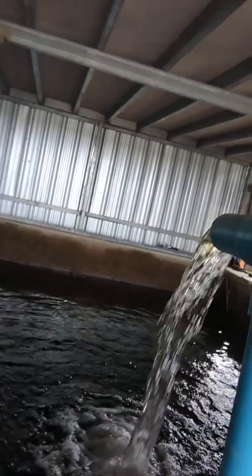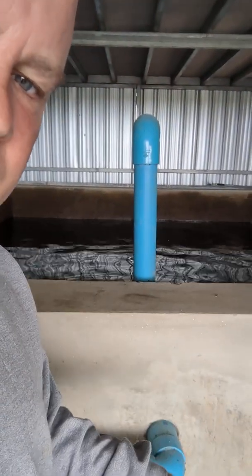When pumping water from a well into the holding tank, you need to get oxygen into the water — so I have it drop to aerate it. This tank is two meters deep, goes a meter below ground level, and holds 30,000 liters — more than enough for the whole farm. Because it's a spa pool pump, it doesn't self-prime, so the intake pipe goes to the bottom of the tank. I fill it above the airlock and once it starts pumping it'll draw all the way to the bottom without losing prime.